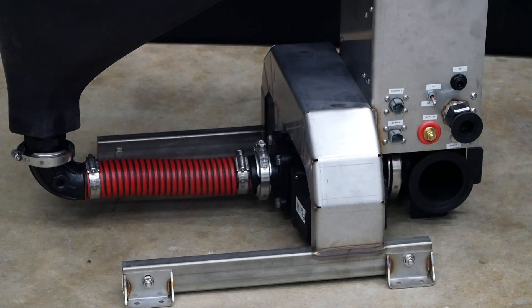Here at the bottom is the main water manifold. This runs across underneath our flow stacks and under our fusion. All of the water and bulk material going into the mix flows through this manifold. We have had very good success with chemical compatibility and effective mixing since we are adding products to this large stream of water. It does not matter which direction water flows through this manifold — whichever way is convenient on your installation, it will work in either direction.